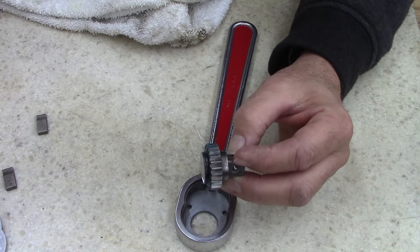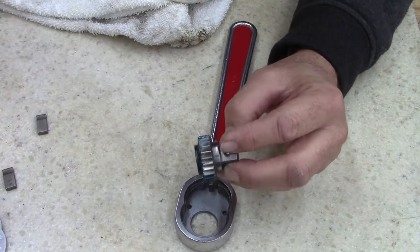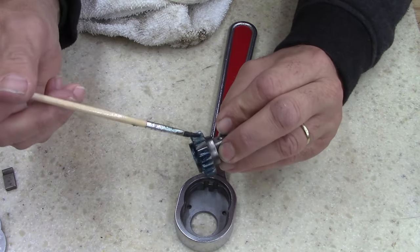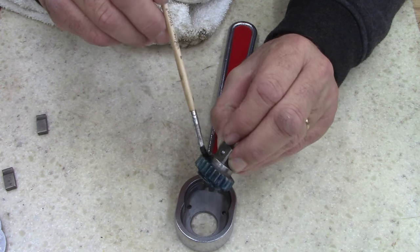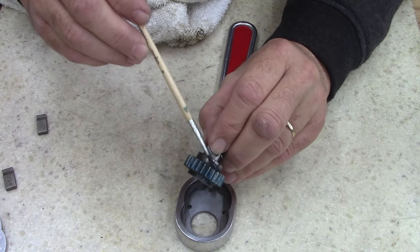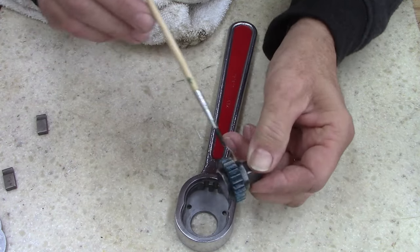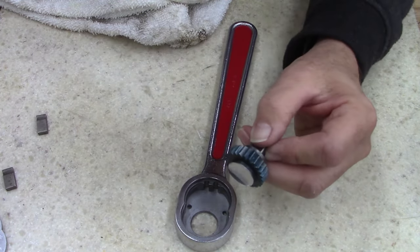And this grease, the company that sold us the motors, or sold us the bearings to rebuild the second motor, told us to use this grease and only this grease, or they wouldn't honor the warranty. So we've been using this Mobil 1 ever since. I get PMIs, which are preventive maintenance logs that I used to take care of the motors. I don't do that as much anymore, but back in the day when I did, I had to go out there, they're grease-certed. So anyways, I maintained the motors. This is the grease I used. We still use it.